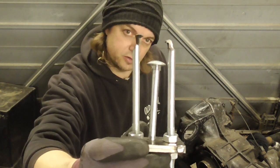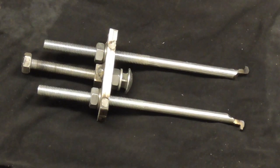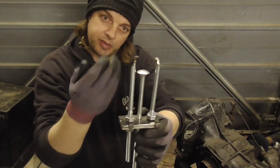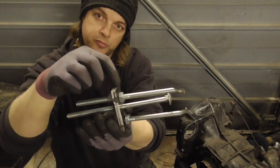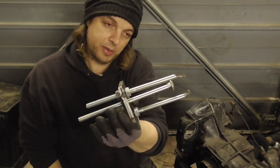That's kind of the design I ended up with — ignore the middle bit. I went to quite a lot of effort to design and shape the hooks on the end. They actually hook into the bearing, and when you straighten them up through the bar, up through the plate, they tighten and actually grab behind the back of the bearing.